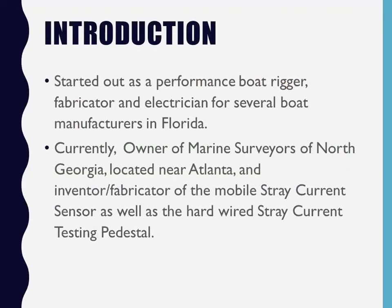I started out as a performance boat rigger in Florida. Now I'm not just a surveyor, I build these and sell them, and I build a permanent pedestal devoted to a dock at any marina. It has four receptacles: two 250 connections, one 50-amp 125 connection, and one 30 amp connection. It's devoted to a fuel dock or any specific dock in your marina for boats to approach, and they get tested before they're allowed to come in and dock. I'll show you pictures of that in a second.